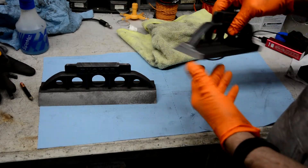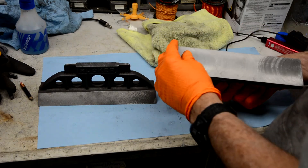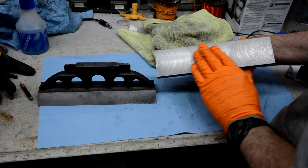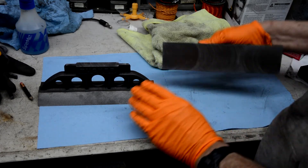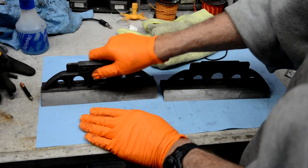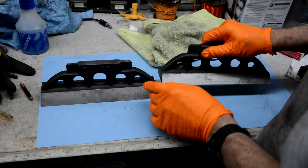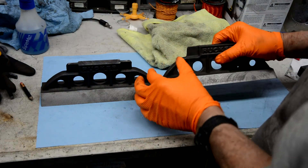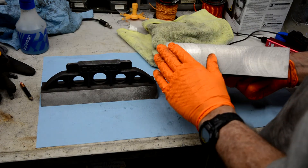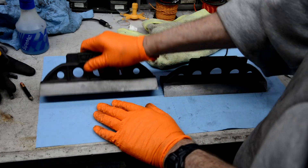The machine's all done. This is the one we just did — I had to take it a little more than this one in order to get all the edges even and smooth. It's got a really nice finish; there's probably a lot less than a thousandth, maybe half a thousandth between the marks on here, which is actually a little better than this one. This one I can feel a couple little spots — there's probably maybe a thousandth. The machine is pretty good, I can get within a couple tenths, but when you're machining something that's hanging out of the vise, even an inch and a half on each side, you still get bending. So I wouldn't be surprised if there's a thousandth bow in it this way — we'll see when we go lay that out.